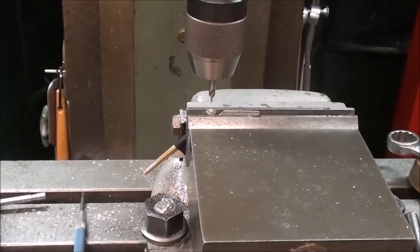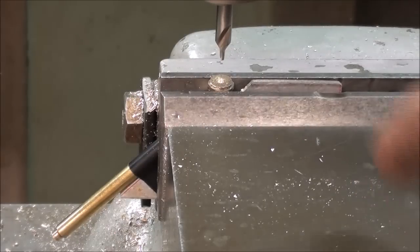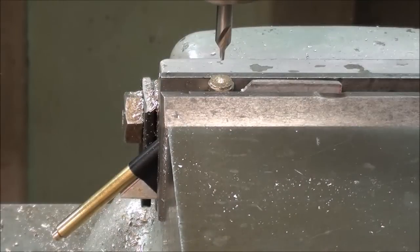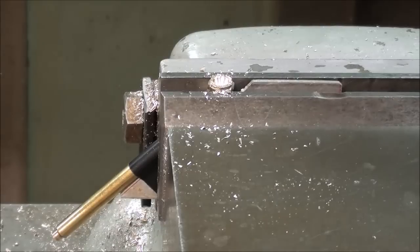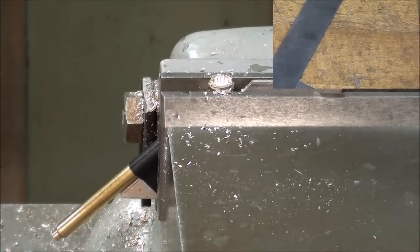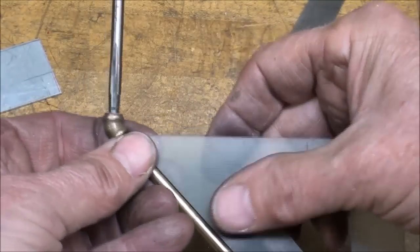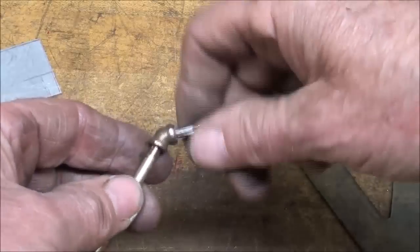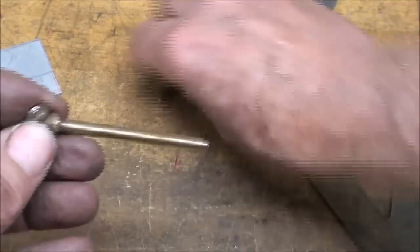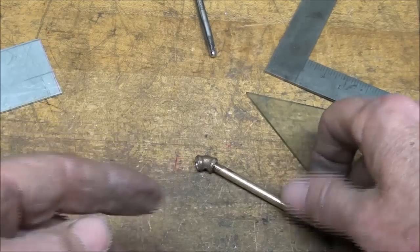Again this is the 45-degree L, and I'm using that same little 45-degree angle guide that I made. I'm sorry to say — and kind of ashamed — I had to use some black tape to hold onto that, but I've already got it positioned, tightened, and tentatively centered, and ready to center drill. The brass grabbed the tool a little bit. The 45-er is done, I think, and if I hold a 45 on here like this and a 90 like this, you can see it looks pretty good. Let me take the rod out of there — that was tightened in there so it wouldn't get away, because that's part of the aligning system — and I could feel the drill meet the other hole.